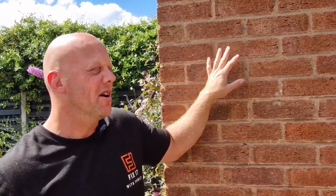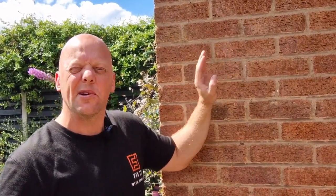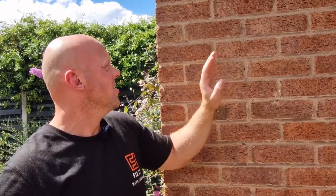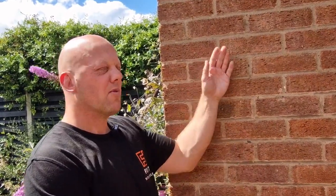If you're fixing something with a little bit of weight, there's every chance it would come off the wall. That's the fixing all in and that's the video finished. Hopefully you found that useful. You now know never to drill into the mortar if you're doing a fixing. The most important thing: make sure you're using the right plug, the right size hole, and the right screw. If you follow all three of those rules, you'll end up with a really solid fixing. If you found this video helpful, click the link below, give it a thumbs up, leave a comment, and stay tuned for more great DIY videos.